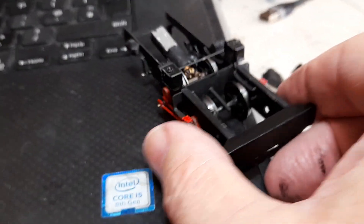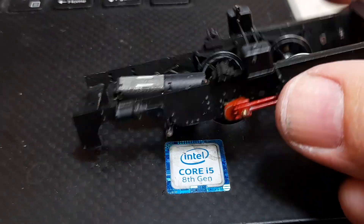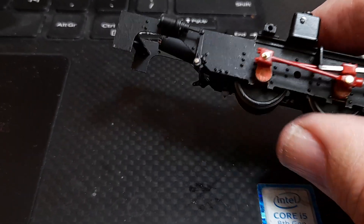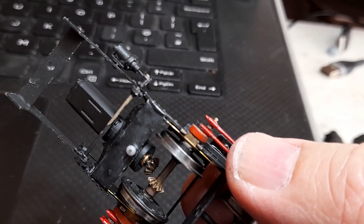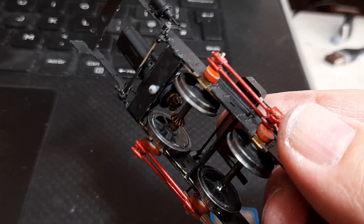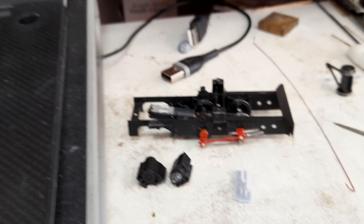To prove it — the motor is disengaged at the moment — the thing is still nice and free running. Push it forward to engage. So we have here printed motion which works fine. Valve gear will be next. I had to insert a slimmed-down nut between the coupling rod and con rod to get the spacing right, but it's as simple as that. Compensation works fine — that's sort of where we are.